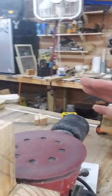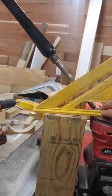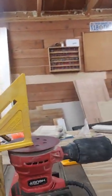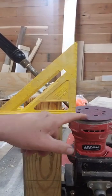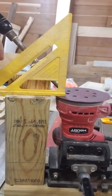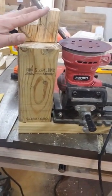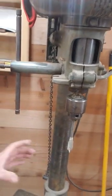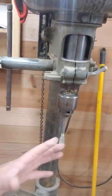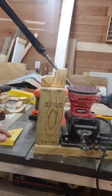Anyway, I took a square — there's a little 50-degree check right there. You mark your board, cut it level with your sanding surface, find your 50 degrees, make a line. Before you screw everything together, I tried to make a true square T so that when I put it on the drill press I could tilt the block and drill straight down to make my exact 50-degree hole.